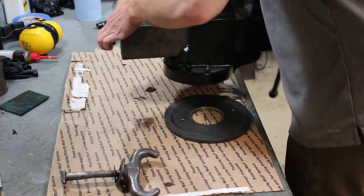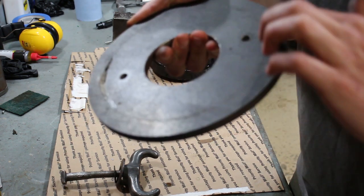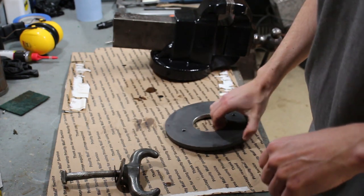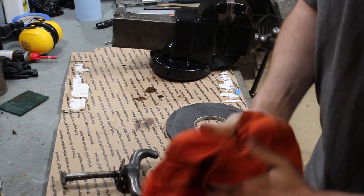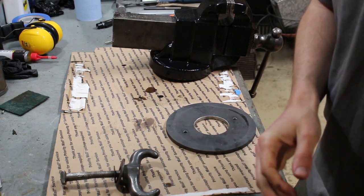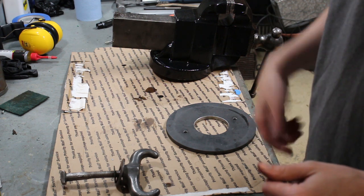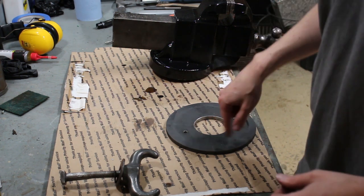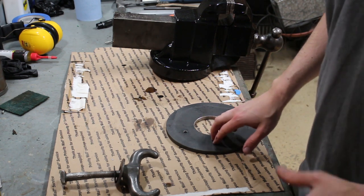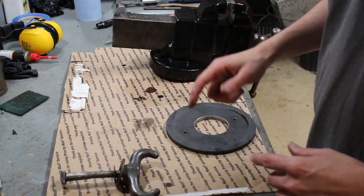But what I don't really like is this has the mill scale on the one side, and it's a little bit smoother on the other side. But I've got one of those paint stripper discs, and they work pretty well actually on polishing things. So I'm gonna get that out on the death wheel, the angle grinder, and I'm gonna do both sides of this, so it'll shine it up a little bit and smooth this. It's not rough, it's just not that smooth. It could be smoother, and it'll smooth that out. So I'm gonna get that set up, and I'll bring you back for that.